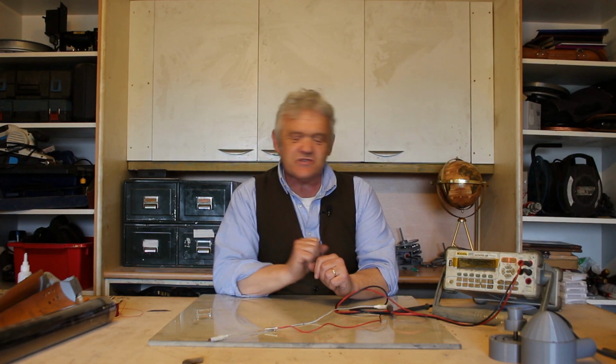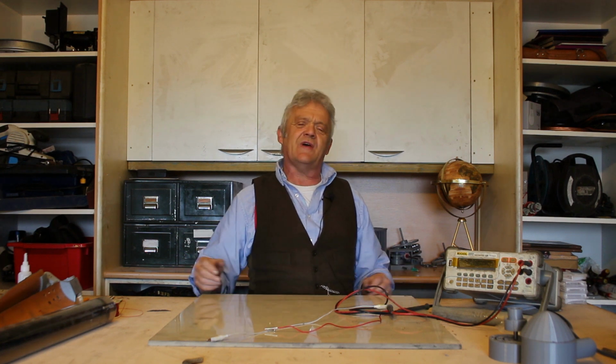It only has one slight problem, and that is it's crazy expensive. It's about $200,000 a ton or something like that, and the reason is it's difficult and dangerous to make. It uses hideous chemicals, things like 98% sulfuric acid, not stuff you're going to want to be handling, and the product is disappointing. It's not really graphene. It's often referred to as graphene, but it's few-layer graphene, or it's pretty damaged, or it's pretty small.